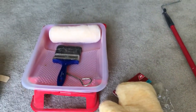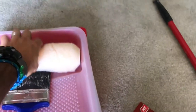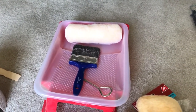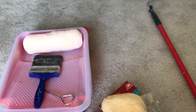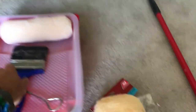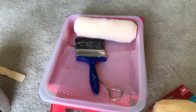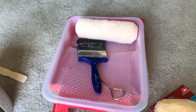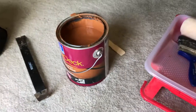As for the rest of the deck, I'm using a three-quarter inch nap roller because it's an aged deck — lots of grain, and you want the stain to go through. I usually use my critter sprayer on small decks, but we don't have electric here so I can't use my compressor. I still use a three and a half to four inch paintbrush for the rails, handrails, and corners where the roller can't reach, along with my nine inch roller.